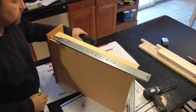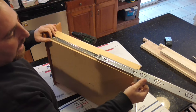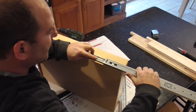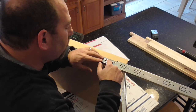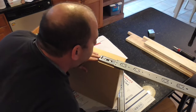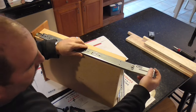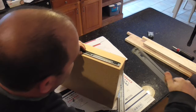With that one screw in, I want to extend the drawer extension. I can open this up — this is the release — and that allows the track to slide out, giving me access to the screw hole. I'll move the track forward, make it flush, and pre-drill and put in a screw at the back. The easiest way to handle the back of the drawer is to order return pieces with your drawer slides; they insert in the back and connect to the back of the cabinet, slipping on just like that. Now the track is on and I can remove it to prepare for installation in the cabinet frame.